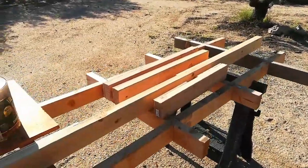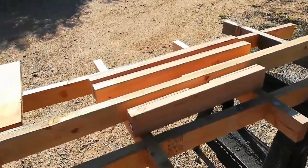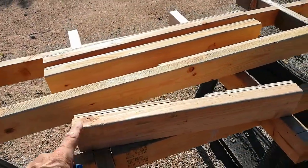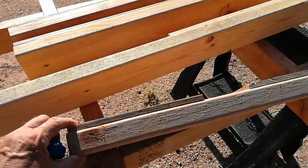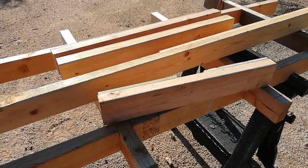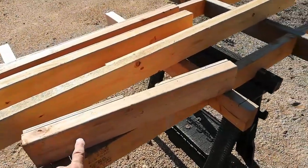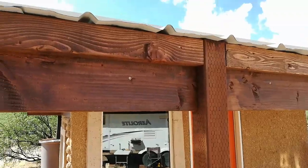Good morning guys. I'm working on the gutters for the new overhang on the solar shed, and in order to make these gutters work, what I need to do is build a spacer that's going to run along the top of the beam. So what I've done is I've taken two-by-fours and widened them with what appears to be three-eighths-inch plywood. This will bring it out flush with the vertical posts that are on the outside of that beam. The gutter will then be attached right to this face here, and I'm going to get everything stained before I install it.